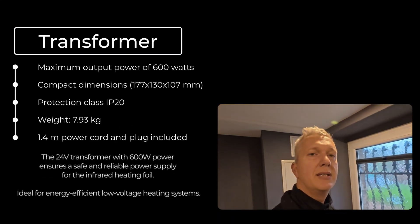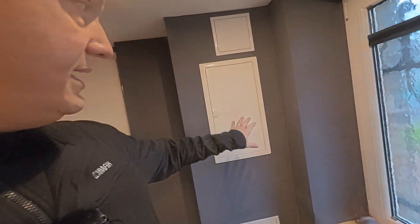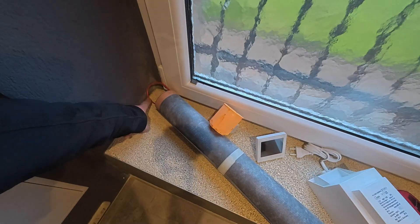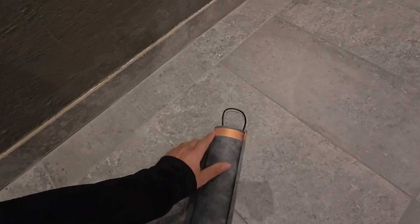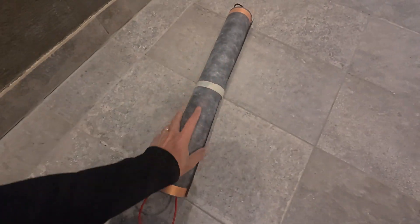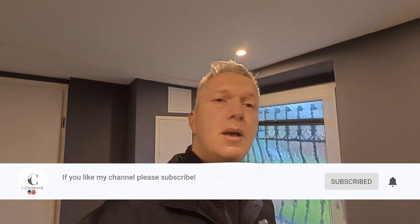This transformer has an output power of 600 watts and is quite heavy — about six or seven kilos. Starting from my fuse box I'll run a cable, inserting a Shelly in between to monitor power consumption. From the Shelly it goes into the transformer, which has two outputs — one for the positive cable and one for the negative cable of the heating film. The film itself is extremely thin, with a copper strip for the negative pole on one side and another copper strip for the positive pole on the other. The fibers in between are coated with carbon or other conductive materials, creating a conversion of electrical current into heat at almost 100 percent efficiency.